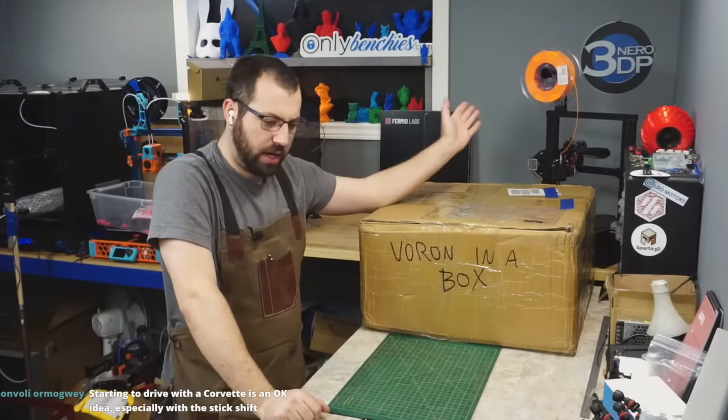Okay, your 16 or your 9mm 20 tooth. It's for your Zed. We're good there. These are 2GT2. We're good there. Some blacks. What are these for? 6mm. I think one of these is for... What are these for? Oh, these are for the motor. Now here's the problem. A lot of these black ones are MXL, and these ones aren't. So they're good there. These are for your drive gear, for your AB and your Z offset switch assembly.